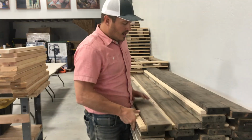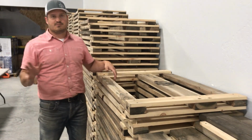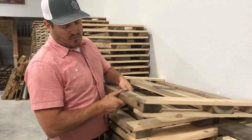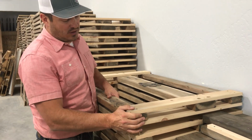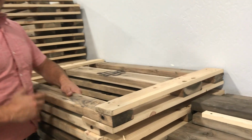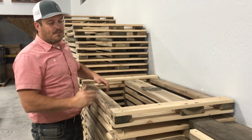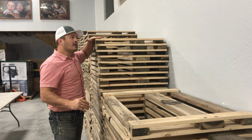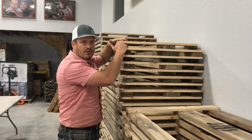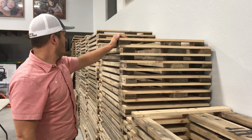Okay? Now let's come down to the headboards. This is kind of personal preference, but you can do it however you want. You can see that we stack these, we alternate them, right? So that 1x4 doesn't sit on top of the other 1x4, it sits to the side. So usually height is more of a concern than width. You can fit about, at eye level for me, which is 6 foot, about 15 bunks worth of one bottom headboard and one top headboard.